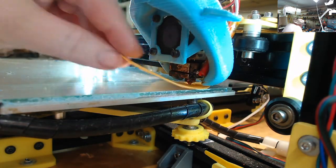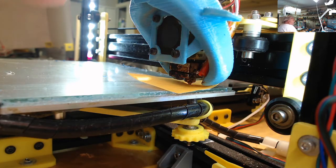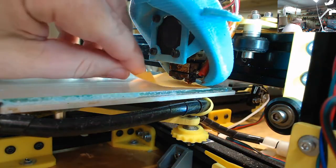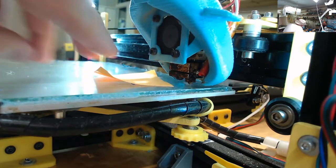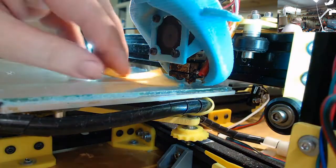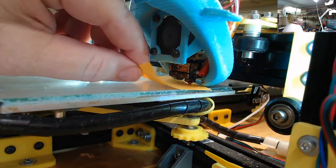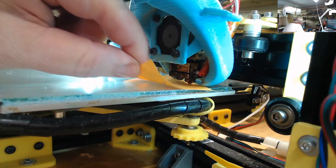Same thing again. And what happens is this bed's hot. So is that nozzle. And you want it hot because metal will flex. So you want to heat this to the temperature you plan on printing at. If it's PLA, it's more than likely 60 degrees C. ABS is a bit hotter. When I print ABS, I'm running it at least to 90 degrees. The problem is this printer and its current power supply, getting this bed to 90 degrees, or for some people 110 degrees on their ABS, is really, really hard. It just doesn't have enough oomph.